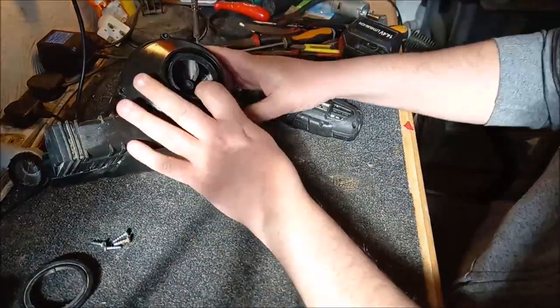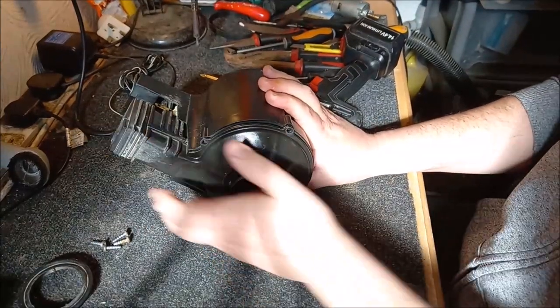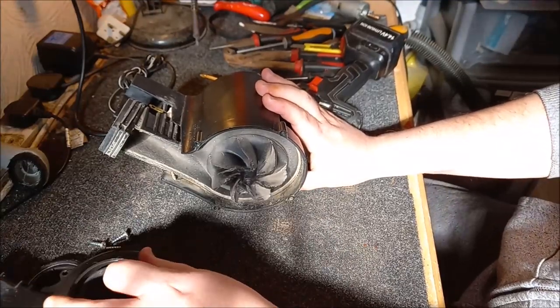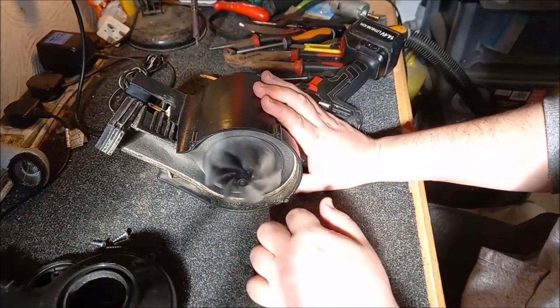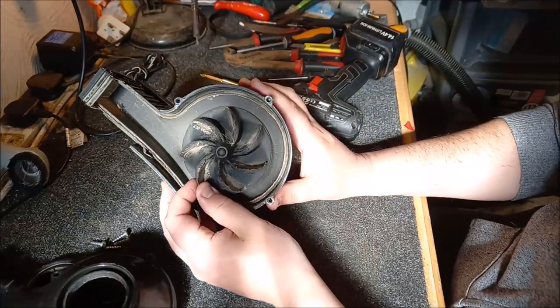I need to change the camera around to get a better look at this motor. Our next task is to get inside it. It doesn't feel too bad — I think we might get away with just lubricating the bearings. But let's take this fan case off because I've got a feeling the fan may not be in the best condition. The screws are out — some of those were really tight — and now this should just pull apart. We've got a bit of a rubber seal up here so we've got to be careful of that. There we go — that exposes the fan. And it's looking a bit... yeah, it's not the best, is it. God, this has done some work.